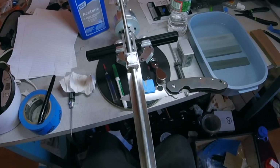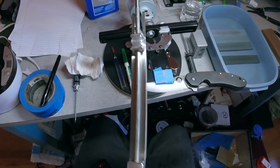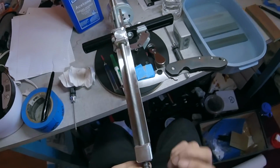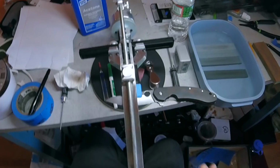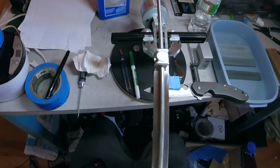that means that it needs to be ground down so that it hits. It doesn't mean you compensate by spinning your stone, because this will work. If I do this and push hard, it might cause the stone to kind of fake that it's the right angle, but don't do that. Just get it right. You know, take the time. See right there, I even started to do it.